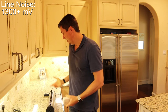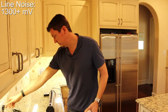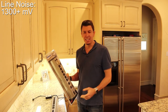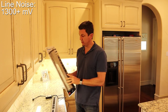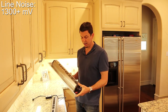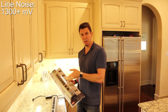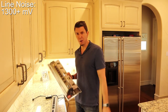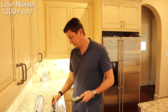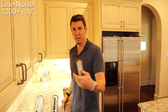The device does some filtering — it's not great, 1300 down to 850 millivolts. The last thing I wanted to do was try one more unit: this is the Furman PST-8D, very similar to the PST-8. The only difference is it has isolated banks, which should help prevent cross-contamination for any devices in the unit. I just wanted to see if that was the case. The first outlet reads about 807 millivolts — same as the PST-8.